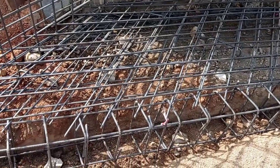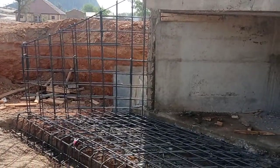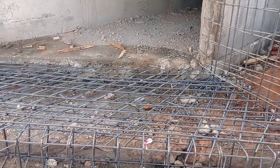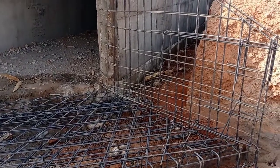You can notice here that the reinforcement bars for the apron had to be skewed because the culvert base had been skewed. A similar process will have to be carried out during the placement of reinforcement in the decking.